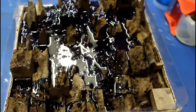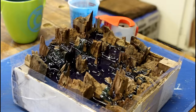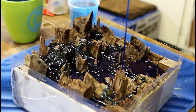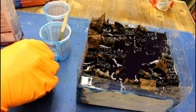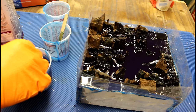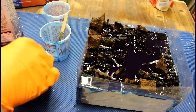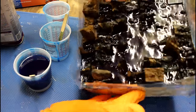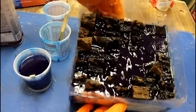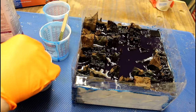Have I mentioned how much this stuff stinks? Open up a window, wear some lung protection. After a while, polyester resin gets to this jelly-like phase where it's not really cured, but it's pretty well soft-set. And you can see here what that looks like — it's the best time to pour another layer.